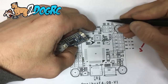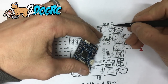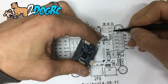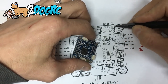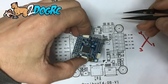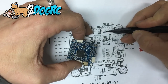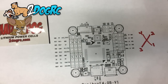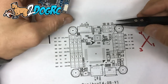This is where the video section is for your OSD. This part is pretty easy: video in is going to be your camera, so the top pin is your camera, the bottom pin is your video transmitter. You take the signal wires from your camera in, and then your video transmitter out. To make sure you don't have any issues with the OSD, make sure you have a ground wire coming from the camera to the board and also a ground wire going to your video transmitter out. Depending on what you're using, you can figure out how you want to wire that.